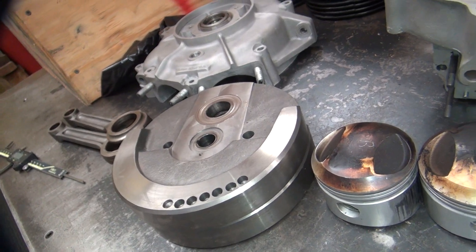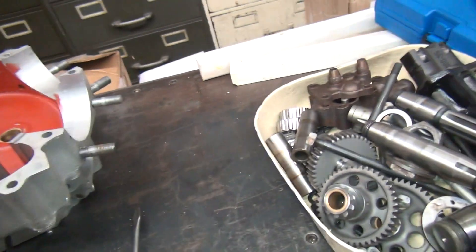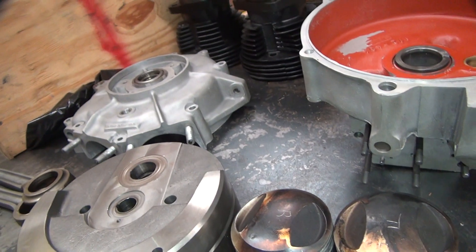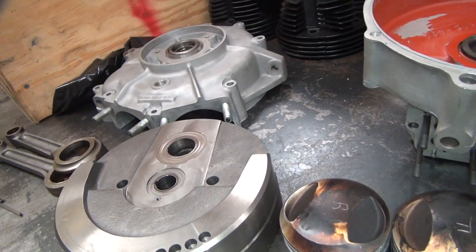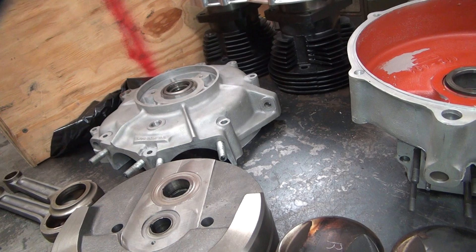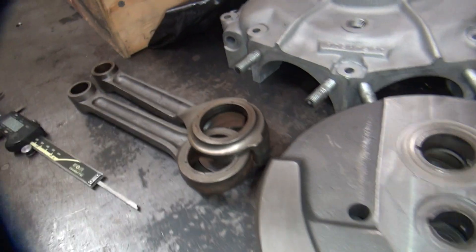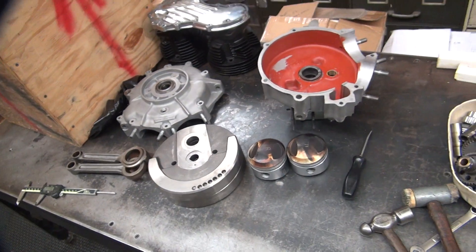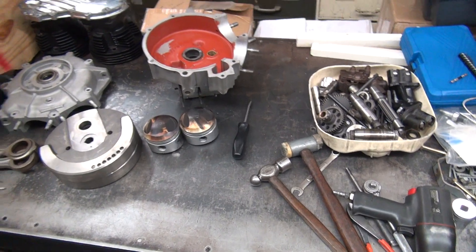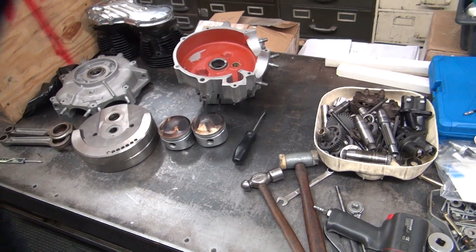More fun stuff to figure out. So there you go — low mileage motor, got a lot of issues. My guess is that the heads need to be taken apart and looked at, but they're basically on a separate oil system because they're up high by themselves, so they're probably okay. But they need to be checked out. Other than that, everything else had a lot of debris through it. Re-pop motor. Not the best. Let's go for it.